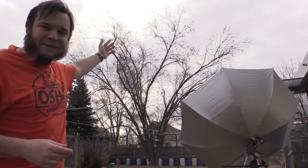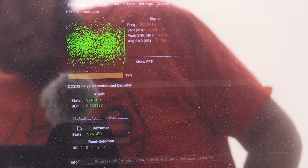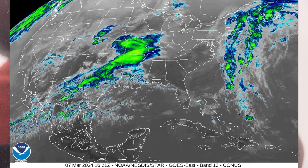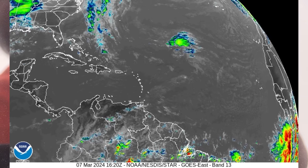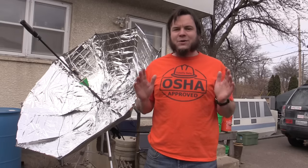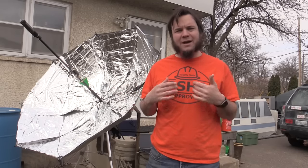There are also a couple of improvements that could be made. For example, I'm aiming basically right through a tree, so if that wasn't in the way it would probably get a better signal. The sun is also right there, so I'm getting some interference. I did my best to maximize the signal and recorded for about 15 minutes. We're getting a definitely more reliable sync in SatDump — running the recording from SDR++ through SatDump to decode the signal, and it looks like it's working pretty well. I've named off a couple of programs I use regularly for satellite experiments; if you're new to this I'll throw links to SatDump and SDR++ down in the description. Most of these are free, open-source programs, constantly being updated — very useful for satellite and radio experiments.